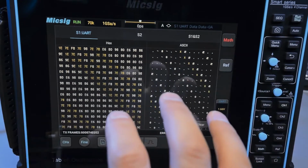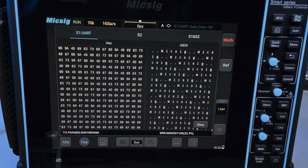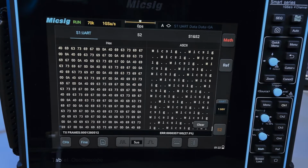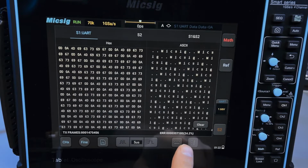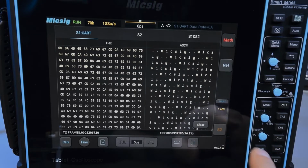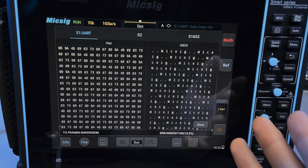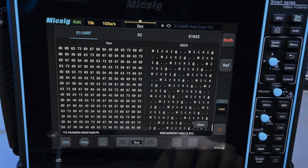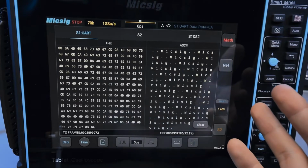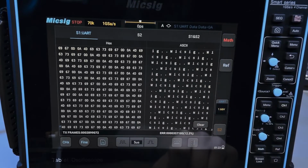And because I haven't set the actual FPGA board to output 1 megabit, now I'll do that, and there we go, it's fixed. And now the errors are going down because the errors form a lower and lower portion of the total buffer, which is being overwritten, right? So when the entire buffer is overwritten, the errors will go to 0. But it's decoding, and then it's not responsive. So I guess you have to wait until it finishes, and then maybe you can go through it like that.